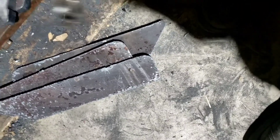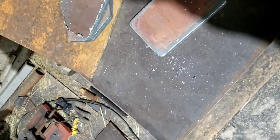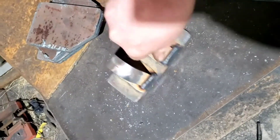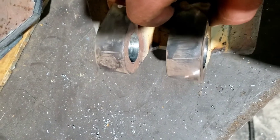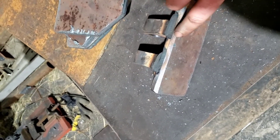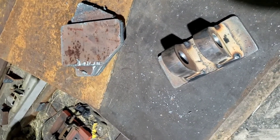Here's some other parts that I've been doing. These are some hinges for the dump truck — I've got a half-inch AR plate. And then I'm building a brush rake for my dozer, so this is kind of what they look like once I've got them all cut out and polished up. There are very little torch marks in there. I just cut everything with it now — this was that half-inch AR plate, same as the hinges. I'll weld that on there, and I cut the arms out for the top of the brush rake.